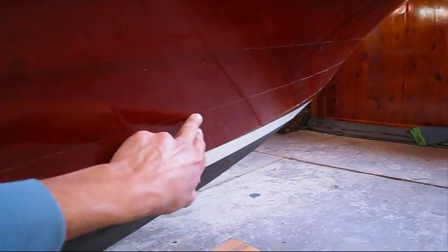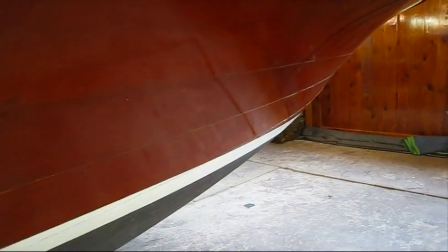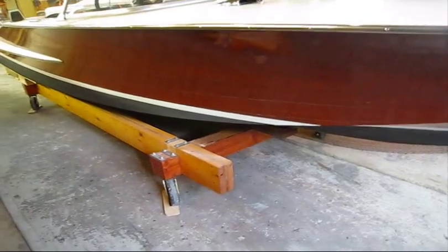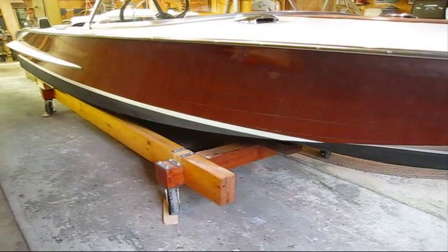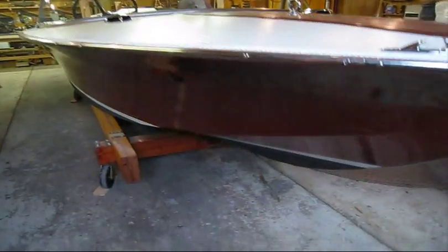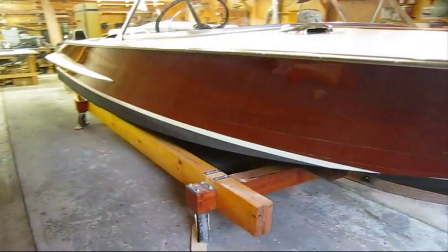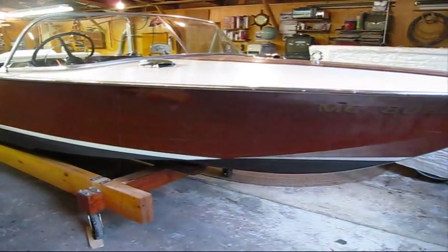On a boat like this that's been used, there are always seams that are broken and sometimes the wooden plugs or bungs protrude a little bit. So you just can't take a mechanical sander and go through and sand the side of the boat, because a lot of times the surfaces are a little uneven and you'll sand right through the color down to bare wood — then it's a pain to try to match that in. It's better to sand by hand and be mindful of those things, and I'll show you how to do that with hand blocks.